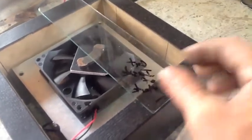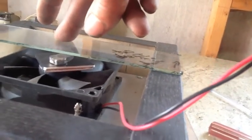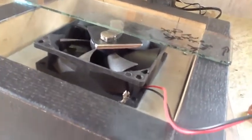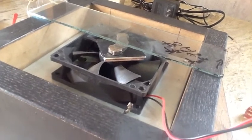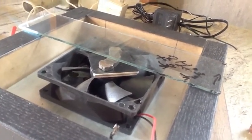When I put my plate glass over the top — I'm going to try and show you — it's just about a sixteenth or so from the bottom of the glass, which is fine, because it's high enough to grab the steel bar in the container of e-juice. But if it's a heavy container and it flexes that glass a little bit, that little sixteenth gives me some cushion. I just wanted to show you the particulars of this thing in case you're building your own. You need a little bit of play so that if your surface bows, it doesn't start contacting the magnet.